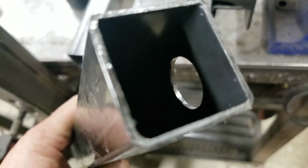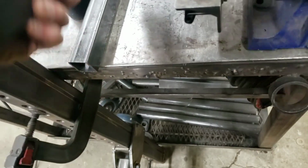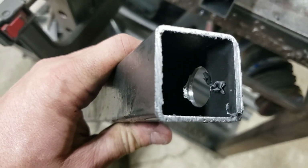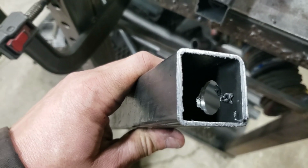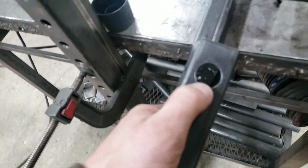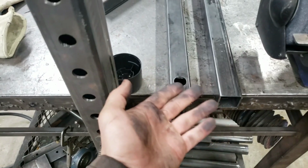Well, you see how clean that hole looks? Like the outside edges of it? All right, there you go, the outside edges of the hole, okay? Now the one where the bit was all gnarlied up, yeah, here it is. You see the results of the friction where it didn't drill through cleanly. So I'll knock that off with the die grinder. But that's what happens whenever that outside edge, that periphery of the circle, starts getting hot. The metal gets hot, and instead of cutting it, it becomes soft and it pushes through. So, all right, I just thought you might find that interesting.